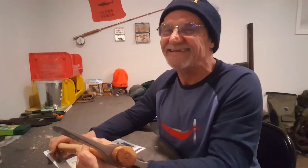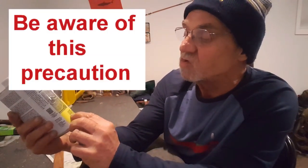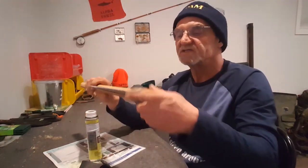Having read up on linseed oil after I used it - they give you precautions right here on the can. It says caution: oil-soaked materials may spontaneously combust. The rag or cloth you use to apply your linseed oil - you're going to have to either wash it or soak it in water when you put it in your trash, because there's a chance if you just throw it into your trash, it's going to combust. So be really careful with the linseed oil. Store all this stuff in a safe place - I don't recommend storing it in your house. If you have a garage, maybe put it in a steel cupboard.